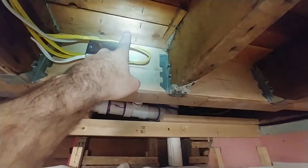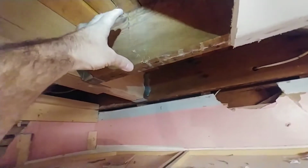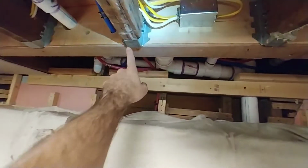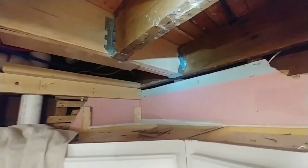First things first, tight to the subfloor to support it. And then you'll notice that some of this older timber is 7.5, 7.75 inch tall, 2x8 nominal, and new 2x8s are more like 7.25. So these were sticking down a little bit. So I've added some plywood here, and I may add a little bit of shim there just to catch that.